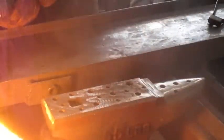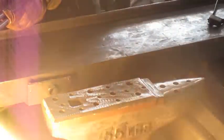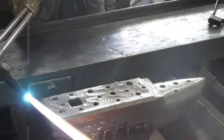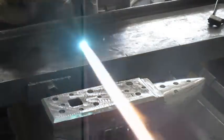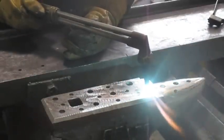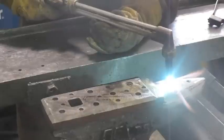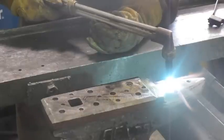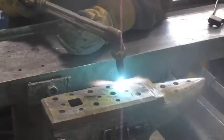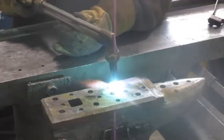Here we're lighting up a torch to heat up this anvil because cast iron definitely needs a preheat to bond well. I tested that if it was too cold the welds would crack. Especially because of the size of this piece — even with regular steel you'd need a preheat of at least 300 degrees.